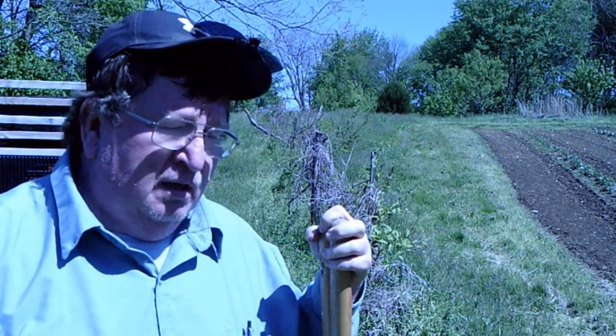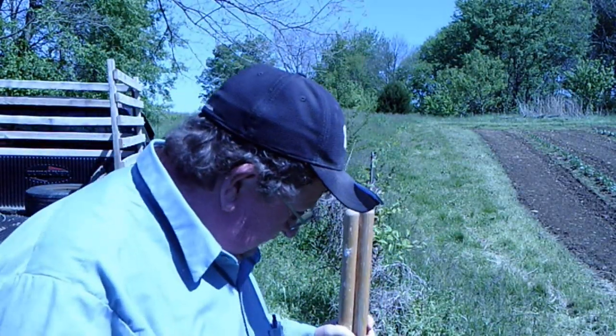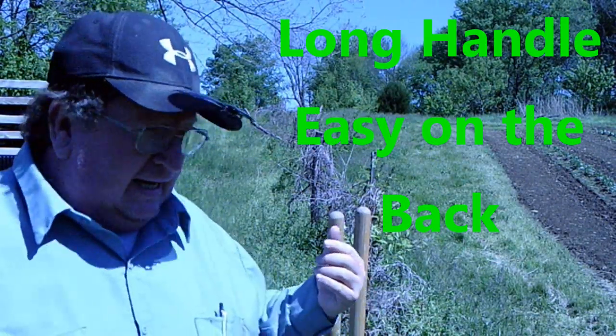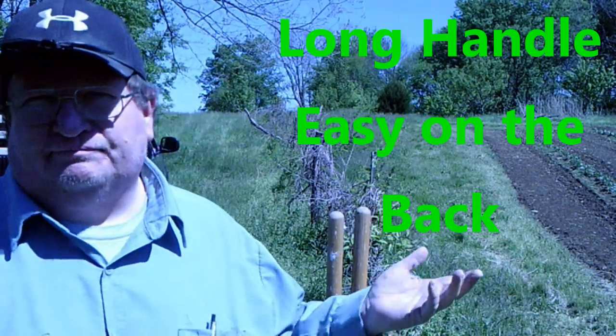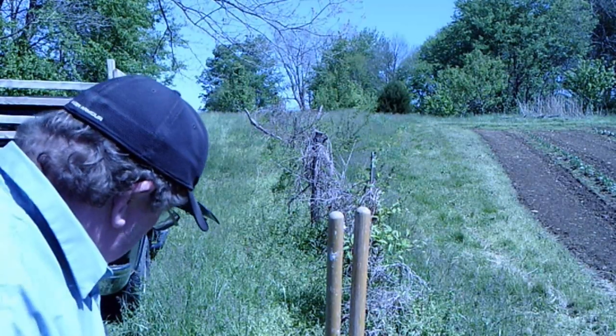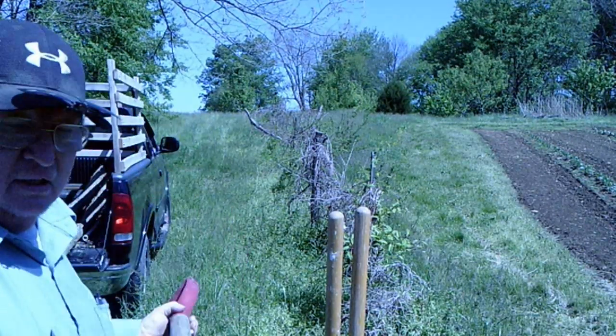What I'm going to use is a regular shovel and what I call a track shovel. Regular shovel, just a spade. This is what you start your hole with, because this grass has got big roots, and trying to cut it with the post hole diggers works you to death. Now once you get the original hole started, use this.